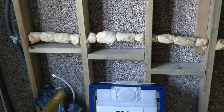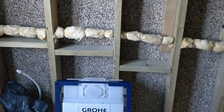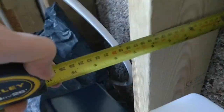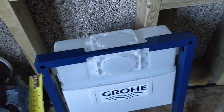Just looking at this false wall and the frame — I had hoped I would be able to sink this into the false wall, but the question is what's the point if it can't. Unfortunately I don't think it's going to work out quite like that. The space here is 150mm and the full depth of this is 155mm. I might be able to squidge it in, but if the front of this frame is not flush with the front of this it's going to stick out.